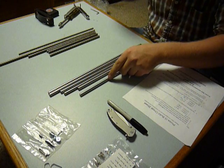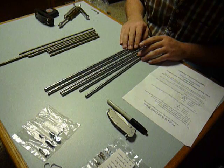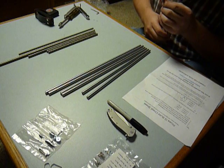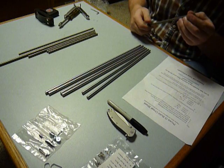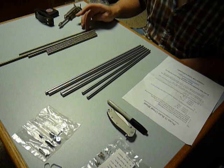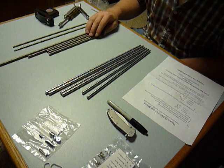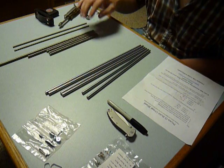Because they will leave nasty burrs. Once they're installed in the printer it might not make much difference, but finish the ends of your rods. The rods that did come from Folger Tech were finished quite nicely — that's always a concern of mine. When you're cutting through threaded rod, you have an easy tendency to booger the ends so that a nut wouldn't start on it. So definitely take a file or your grinder and chamfer the ends so that you have a good start.